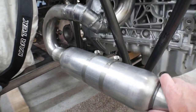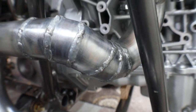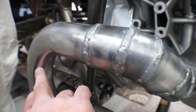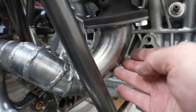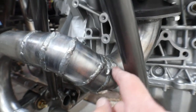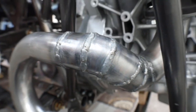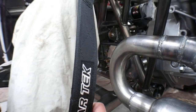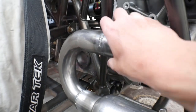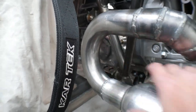All right, here we have our finished product. The glass pack is sitting on its stand, which is welded to the chassis. This side I've got all these pie cuts in here — I had to do that because I couldn't get all the turns done with these pre-bent 90s, because this flange was at a tighter angle than on the other side. So I used what I could, but once I got to there I just had to come up this way and then go back this way, so I did it with pie cuts. It looks kind of cool but it just doesn't look beautiful. I'm going to have to do something about the limiting strap here, but I do plan to wrap these, and I'm thinking that once they're wrapped, if the strap bumps into them it won't really be a problem. I still have to weld a bung on here for the O2 sensor as well.